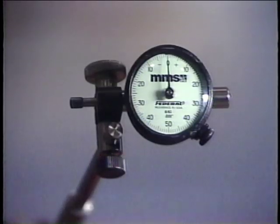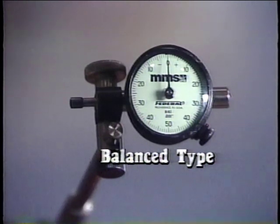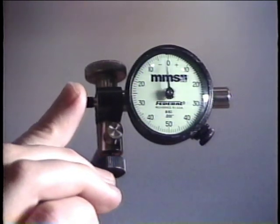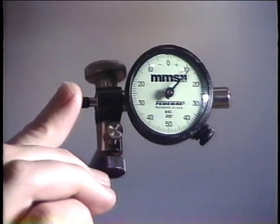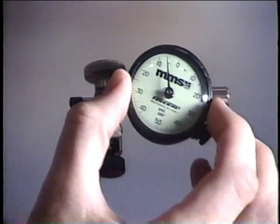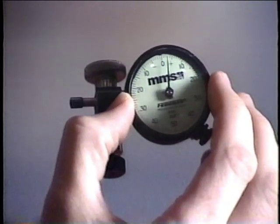The rest of the preparations we'll be discussing involve dial indicators, so let's take some time to discuss them. There are two types of dial indicators typically used for alignment work. The first is called a balanced type — it has a face graduated in thousandths of an inch, or mils, and is operated by a plunger or stem that moves the hand on the face. Inward movement of the stem moves the hand in a clockwise or positive direction; outward movement moves the hand counterclockwise in a negative direction. The face can be rotated to set the reading to zero with the stem in any position.